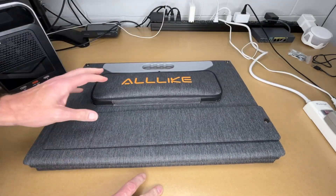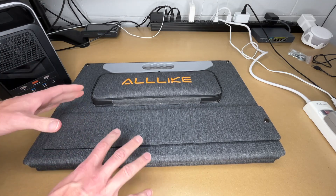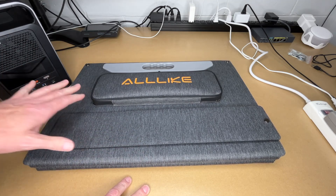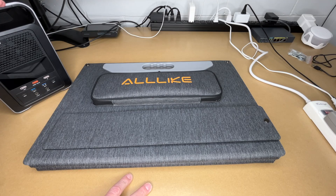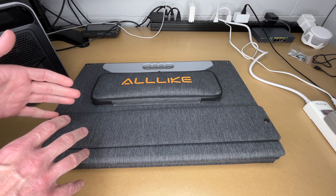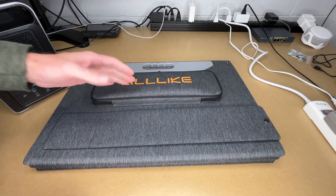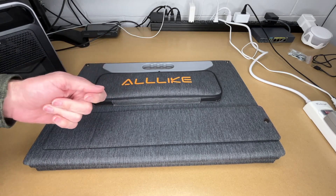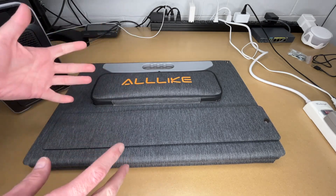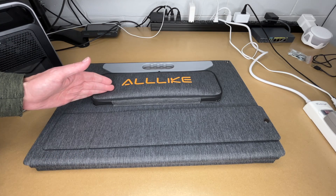As I mentioned in the video, for the most optimum solar you really need to aim it and re-aim it throughout the day, and I found it very easy to do with this panel. I was using this with the SN1000 portable power station, but it should work with other portable power stations that support 100-watt solar panel input. It has MC4 connectors and the XT60 connector, which connect to pretty much everything — or you can get adapters.